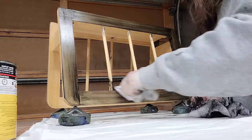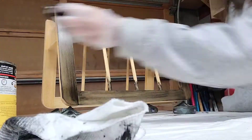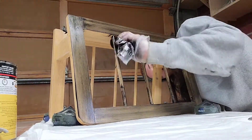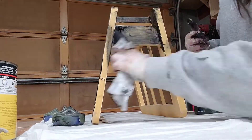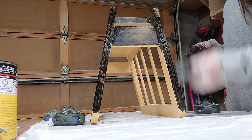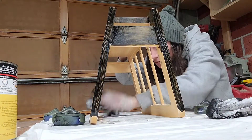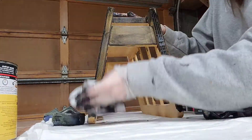Apply the gel stain pretty generously to the surface and let it sit for a few minutes before wiping off the excess. Minwax instructions say to let it sit for about three minutes. When wiping it off, wipe in the direction of the wood grain in long strokes going the whole surface of the piece. Gel stain is a little trickier on large pieces like a dining room table because it's important that your strokes are nice and straight and smooth, as they mimic the grain of the wood.